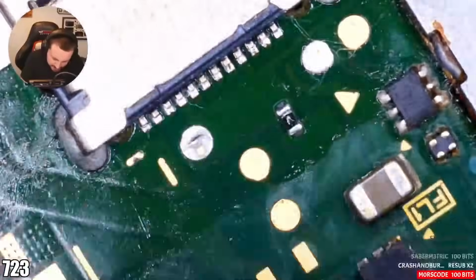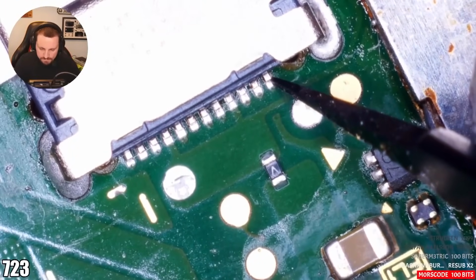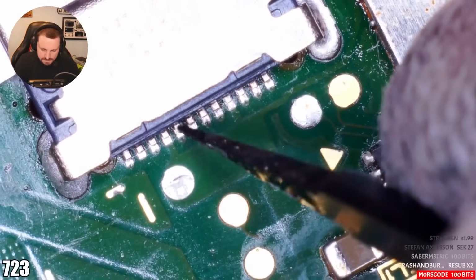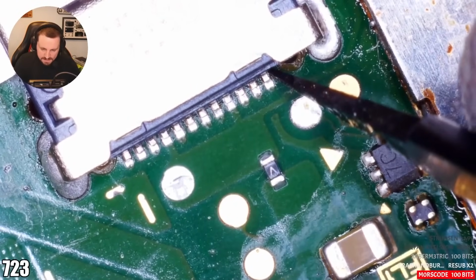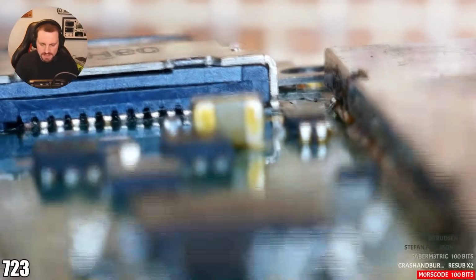This might not be okay. The pins might look okay here, but they might be awful. You never know until you give it a test. Now, are these pins solid or not? Let's have a look. That one isn't. That one isn't. That one is. That one is. So the ones underneath, am I confident that they're going to be okay? Not too sure. How flat is the port? It's over. Can you see it's a little bit up there? So I'll attempt the reflow again.